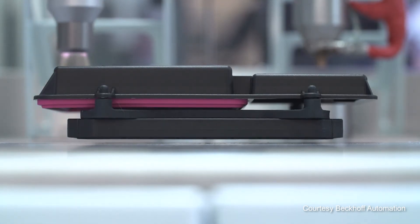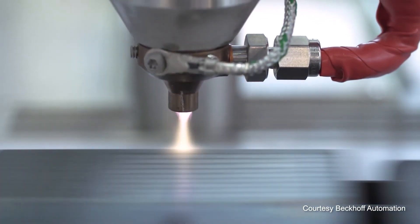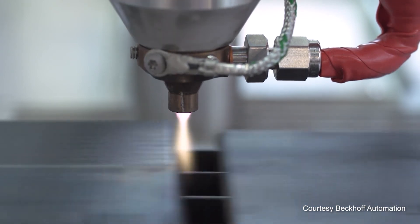You can assemble multiple sub-assemblies on the same platform and then bring them together to do the complete assembly at the end. If you need to rework a part, you don't have to wait until you get to a reject station — you simply take that part out of the product flow and take it to the manual rework station. One machine can handle more than one product type, as you can easily pick and choose the stations you need to go to. You're really free to design a revolutionary machine because you don't have the limitations of how you move a part from A to B. It's not just a transport system — it's the heart or backbone of your system.